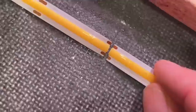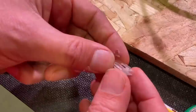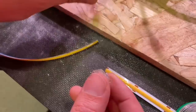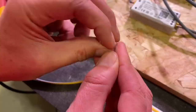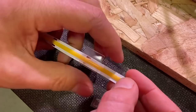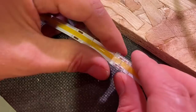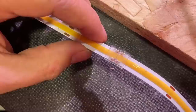Something I find quite challenging is when I have to join two LED strips together. Again with this IDC system it is incredibly easy. Similar process — you can see the metal pins we've just used to connect the wires, and the same heat shrink. Top tip here: make sure you put the heat shrink on before you make the connection, otherwise you'd have a long length of LED tape to run it down. Same principle — yellow side up for the phosphor strip, metal pins up, just push the LED strip in, then bring in the pliers and punch through.